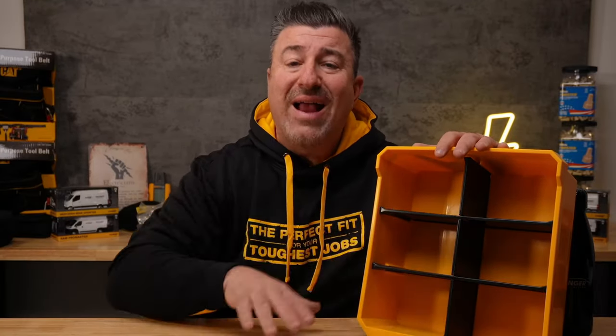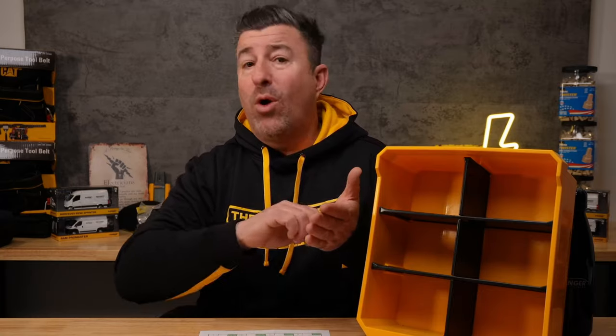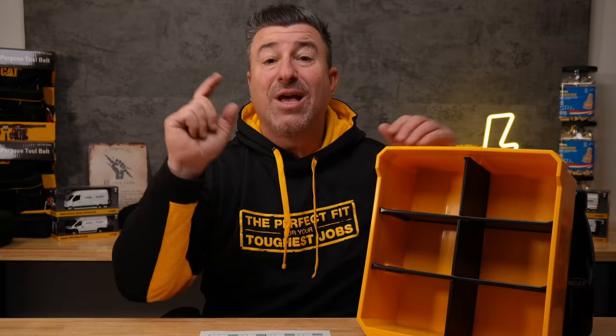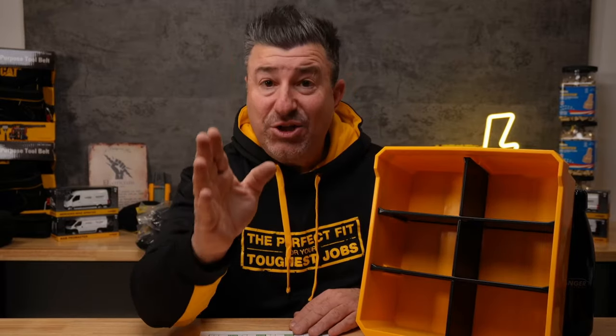It's so important to diversify and have as many parts as you can on the van. It doesn't mean you need 50 Romex connectors in here, but you probably need 10. That's not even to do the whole job — when you sell jobs, you should have a parts list you're filling out at the job site: I need 12 Romex connectors, 25 straps, 400 feet of this, whatever the case may be. You go buy those from your wholesale house. But let's say you needed 15 Romex connectors and only brought 12 — that's when you go into your rolling warehouse and pick the three extra. It's not made to do every single job; it's made to be a backup so you can finish every single job.